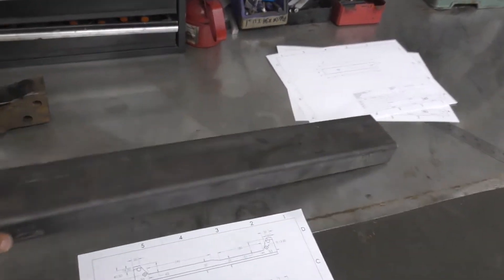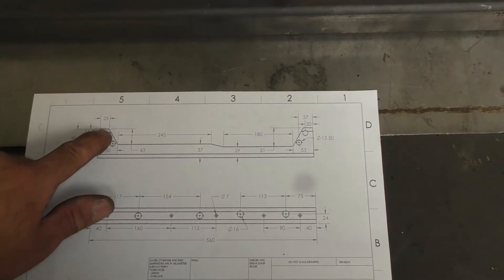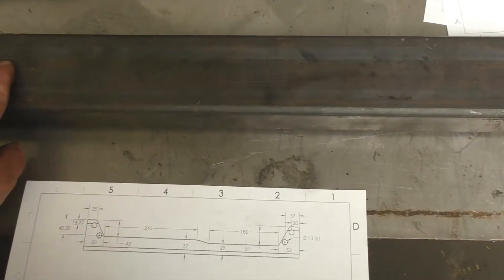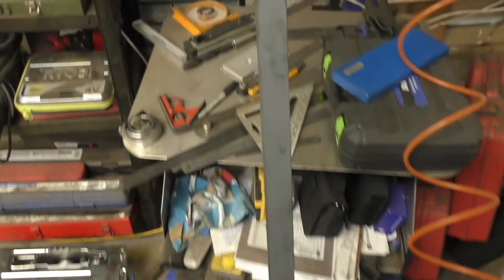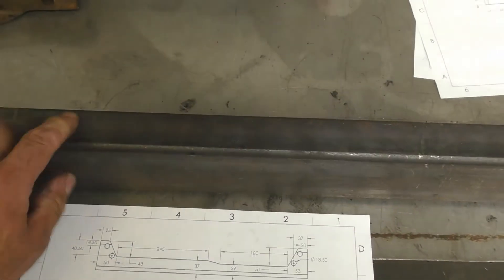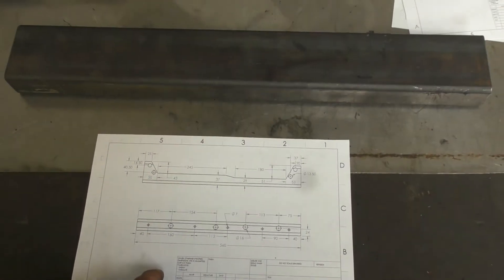It's going to take a good effort to make but I just enjoy making stuff myself. Fast-forward to the workshop — here's the 80 by 40 rectangular section, 5mm thick, really heavy. The plan is to trim that shape in here. I've also got the flat bar, 8mm thick, really heavy, with the cuts and holes for that. That piece will box up the cut, because once you cut the box section you lose the top bit obviously. That's the plan — crack on.